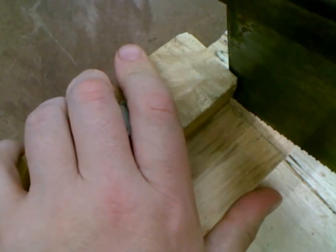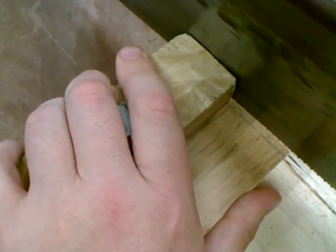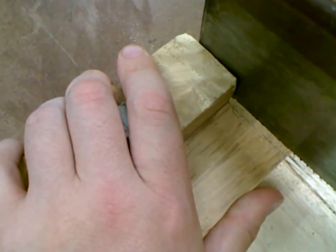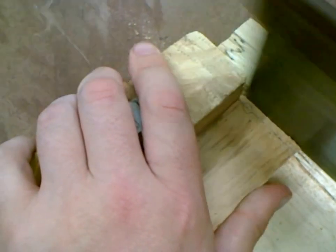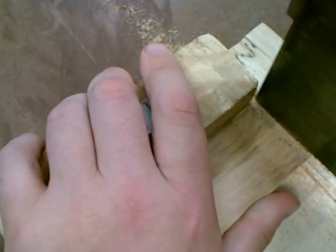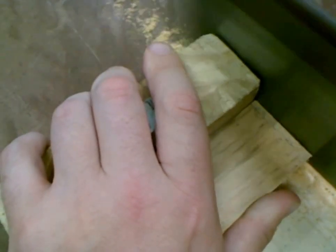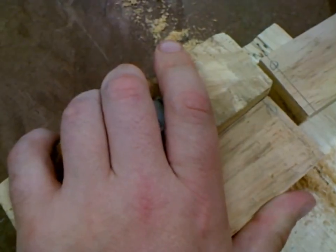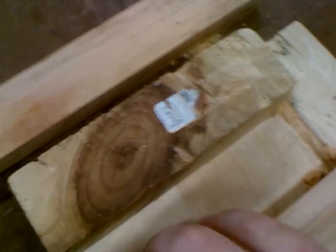Once I've done that, I can then rest the saw in the groove, lay the saw straight, and start to cut, okay? Really important to notice that the saw is very long, so I don't need to sit there and do small cuts. I need to use the whole blade of the saw, and this is going to help me cut faster and more accurately, okay? And that's it. I've now cut straight through, okay? I now also need to do the other piece.